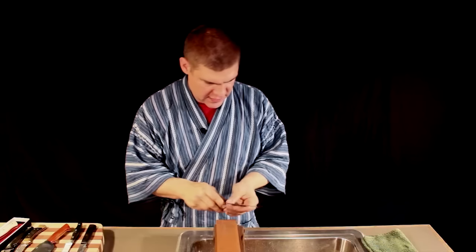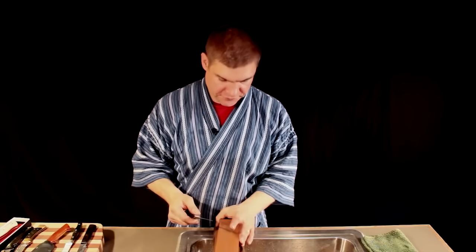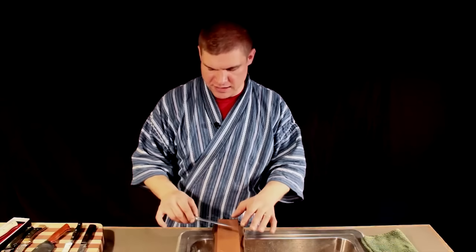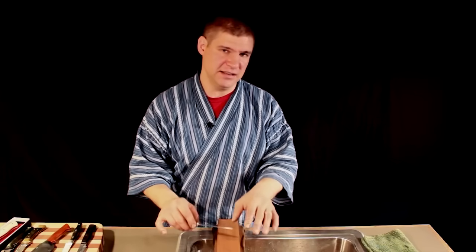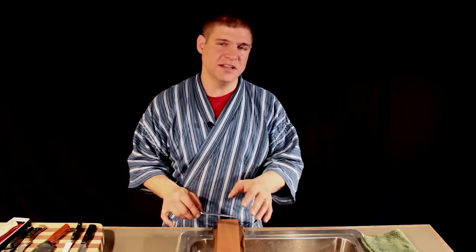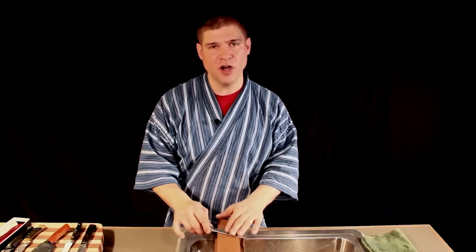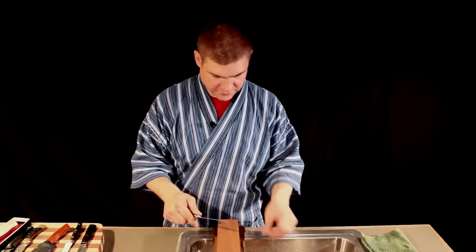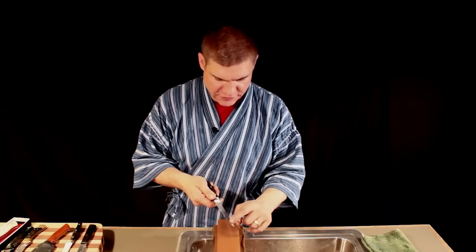Now, how low? Here's the thing. When you are sharpening knives freehand, you can't be perfectly robotic in keeping a perfect angle for your back and forth motions. There's going to be a little bit of rocking in your body and your wrists. It's a little bit. This is an exaggeration. So given that there's a little bit of rocking in your body, it's better to be too low and right on rather than right on and too high. Because remember, anytime you come high up on that stone, you're undoing all that hard work that you're trying to accomplish. So I tell people that if you're getting some scratches on your secondary edge, when you're actually trying to grind in a new primary edge, then you're just about right.